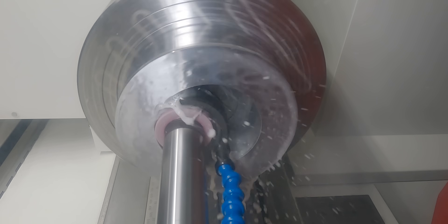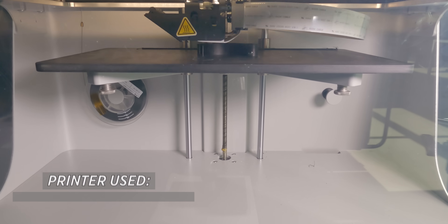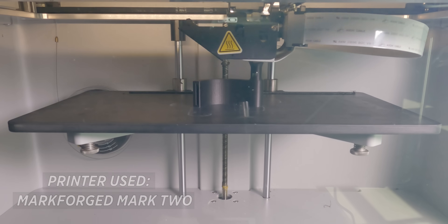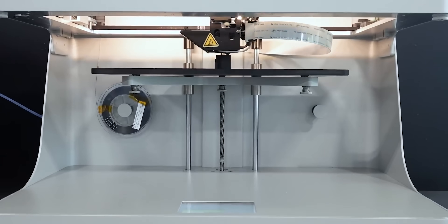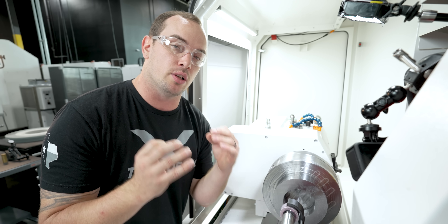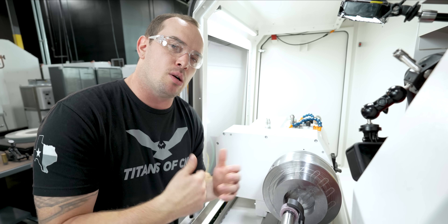We added slots to the inside that will deliver the coolant radially along our wheel to flush out any swarf. These nozzles are generally pretty small — this one printed in less than two hours and cost less than three dollars. This isn't limited to just grinding; you can print nozzles for the mill or for the lathe, and you can also do air knives for assembly lines or clean rooms. The possibilities are literally endless.